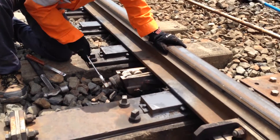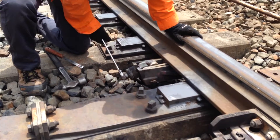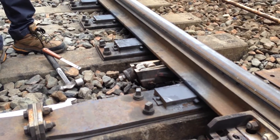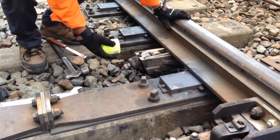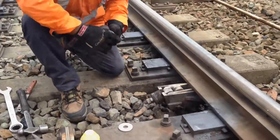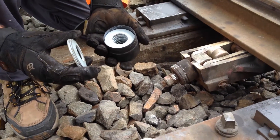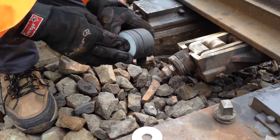And that ladies and gentlemen — then you go and do the rest the same way. Just showing you what's inside this little cup here: it's a series of concave washers and they go back to back to each other, and that's what gives you the pressure. And if you do run out of adjustment, you can add some more washers just like that, and that cup goes in there like that.